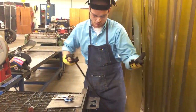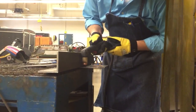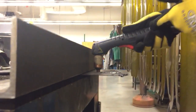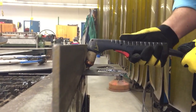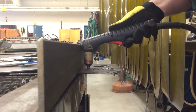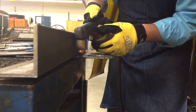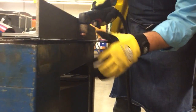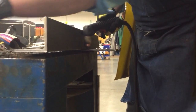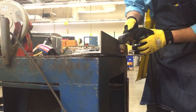I've got my cord set up and I'm ready to go. I'll set this right here — it makes direct contact. Looking at it from a cross-section, I have the piece up and down, but my actual torch handle is at an angle. A lot of you are going to want to hold it that way, but we need you to hold the actual tip perpendicular to the surface so you get a nice clean cut. I'm bringing it right to the edge, starting away from it so you can see what's happening. You'll see that initial fire, and then when it comes in contact with the grounded steel it completes the circuit and you'll get a lot more fire to cut the steel.